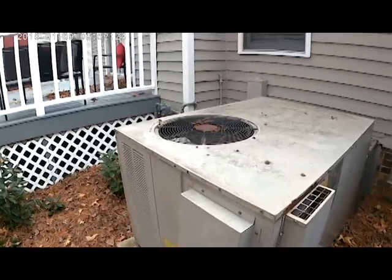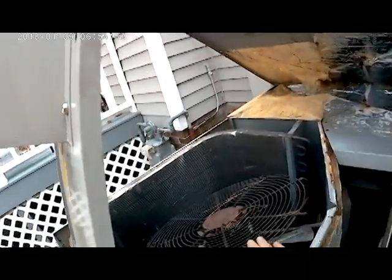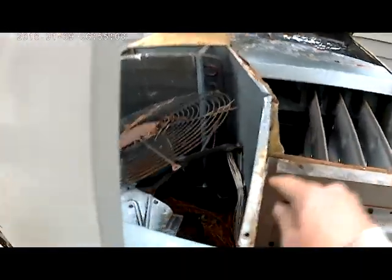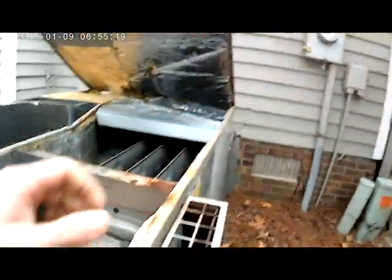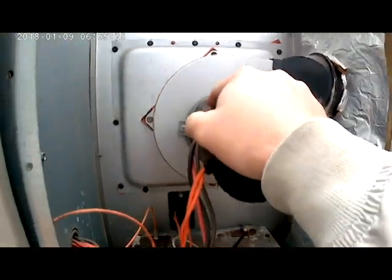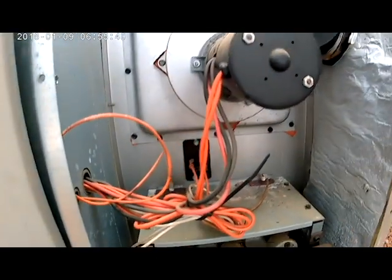I got the top off and all the screws out. I set the condensing motor down right on top of the compressor, with the service door holding everything up. When we replace this heat exchanger, it's only held in by a few screws — one here, one here on the sides. You also have to take this compartment off. We'll need to remove the inducer assembly, the burner compartment, and the limit switch, and set those to the side.